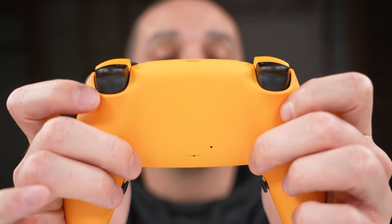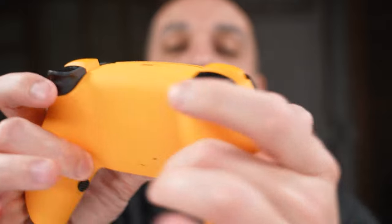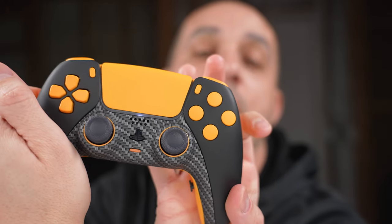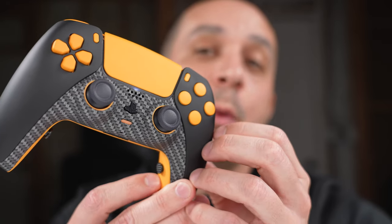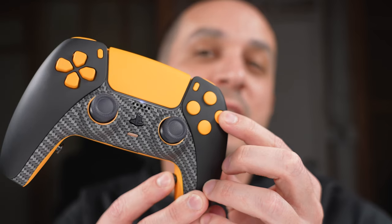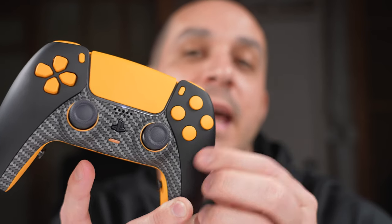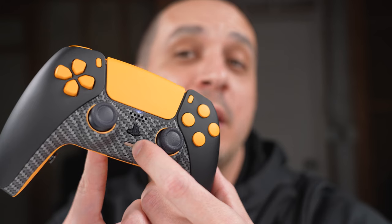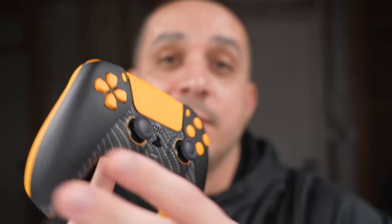On this specific controller, Battle Beaver has designed it so you hold the uppermost two back buttons and push the mute button — that enables your ability to restart the remap process. Then from there, you press whatever back button you want to remap. So I press it, then I wait for the button to blink — you can see the mute button flashing quickly. Then I release the back button, and that has successfully been remapped. You just repeat that process on any of the buttons you want to remap, then press the mute button again and it records that remap.